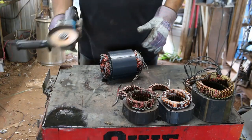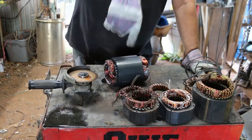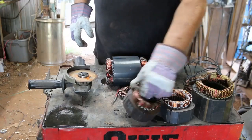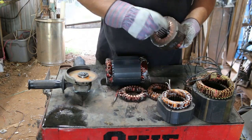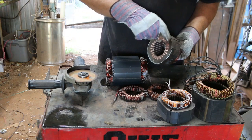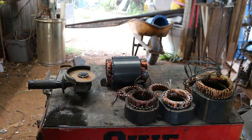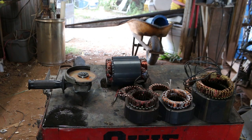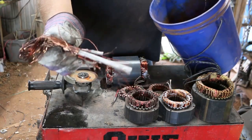I'll cut the ends off of this one and show you how I do it. Usually I use an angle grinder. Some people ask why I don't use the plasma cutter to cut the sealed units open — a lot of times the problem I have is these little plastic inserts, the plastic sleeves. It gets too hot and these plastic sleeves start to melt and meld to the steel and copper, making it very difficult to pull out — they're basically welded in there.